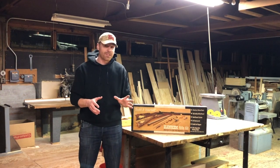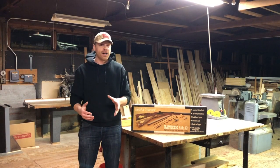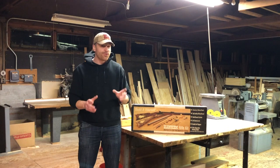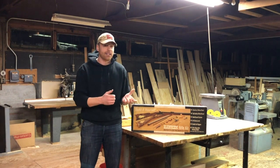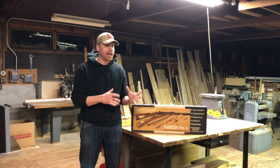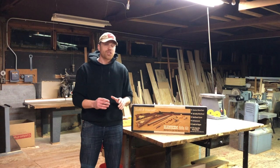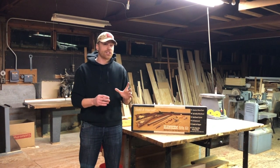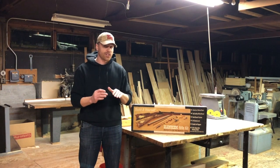We also spent some time rough sanding the stock, and I thought that we were done and ready to move on to finer grit sandpapers. But then I remembered that there's a few areas where the hardware gets attached to the stock. There's a pocket cut out, and all those pockets are deeper than the hardware is thick. So we're going to have to carefully sand down the area around those pockets so that the transition from the wood stock to the metal hardware is smooth and flush.